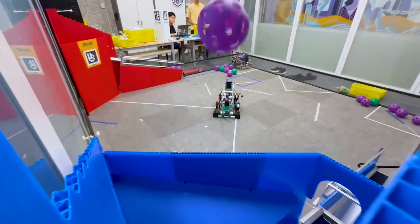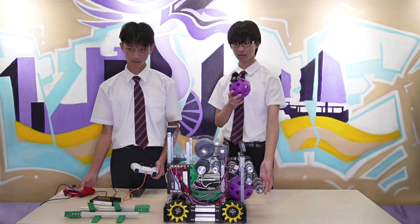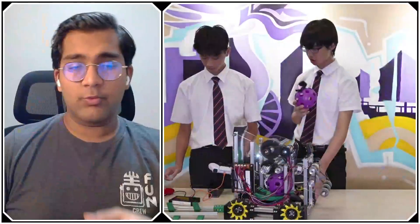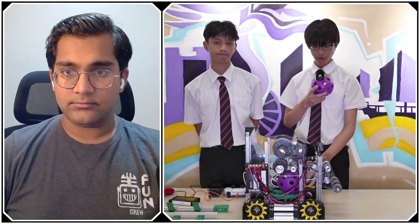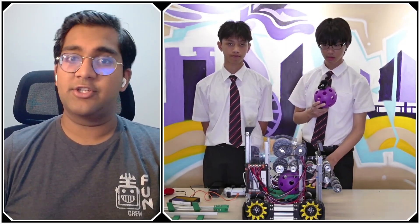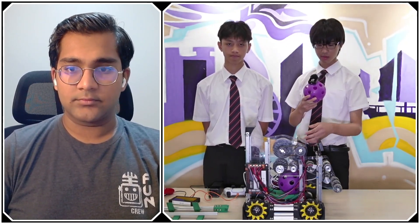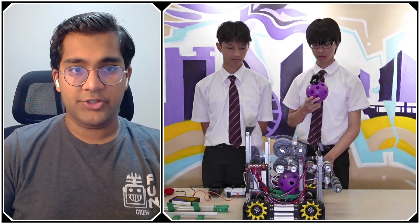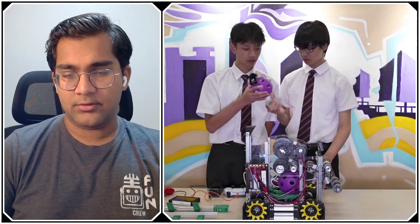Would it be possible to see a shot right now, just to see how that exit path is? Talking about the two motors versus single motor discussion — did you start with two motors or move up from one? We first experimented with one motor, and then decided that having two motors is better because it prevents one motor from overheating and distributes the load evenly. Were you having overheating issues with just a one-motor shooter? Yes, a little bit of overheating because of the match length — if we're powering the motor continuously throughout the whole match it gets pretty hot and draws a lot of battery. Right now you're running the motor continuously the entire match without stopping between cycles — that's correct.